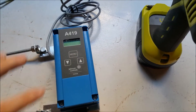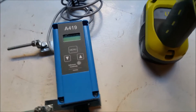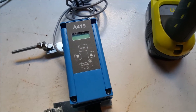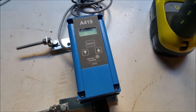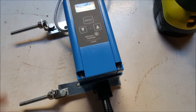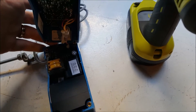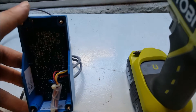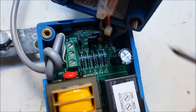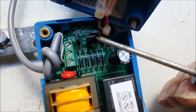The unit itself has four screws, one on each corner — unscrew those and open it up. I've already unscrewed it. Remember, I'm switching from heating to cooling; when you get this unit it's already going to be in cooling mode, so just reverse the steps I give you. Open it up like this — be very careful not to overextend it, because there are wires to the top circuit board that you don't want to snap off.